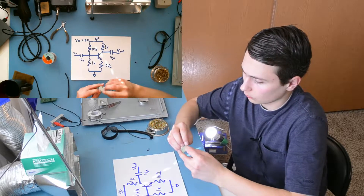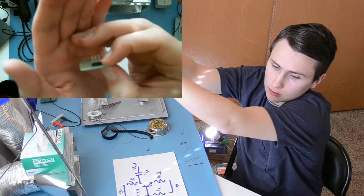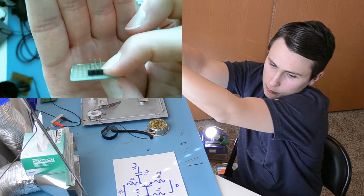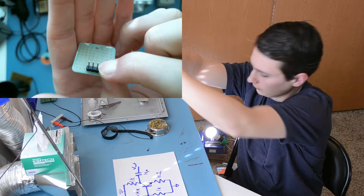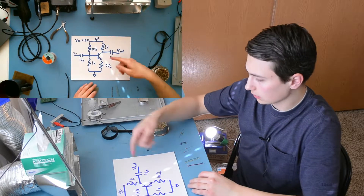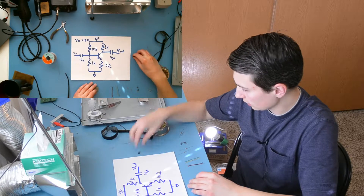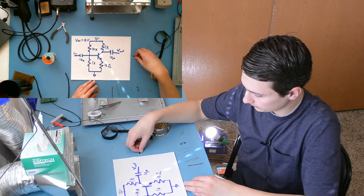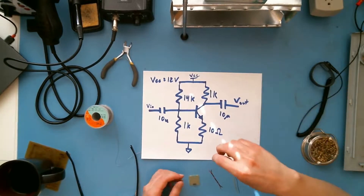I will have one terminal block here with the input voltage, the output signal, as well as a ground connection for our oscilloscope, and then the transistor — the 2N2222 — as specified in our LTSpice simulation, and the other resistors required. Without further ado, let's go!